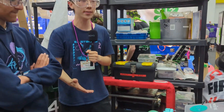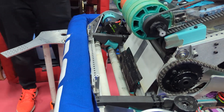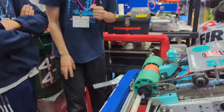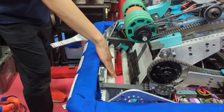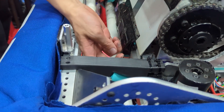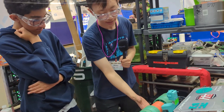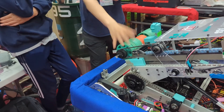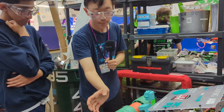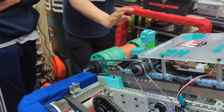Because of the large range of motion the arm requires, it inherently introduced a big gap between our intake and the handoff. We tried to find a lot of ways to overcome this gap. We have several iterations of the intake — we use a polycarb tube with silicone roller setup, a Delrin setup with custom tube plugs, and small 3D printed roller deflectors. This sends the note to the middle of the intake and gets it sent up to the handoff. Because we really wanted to be able to adjust the geometry of the handoff, we made custom compliant wheels — we printed our own mold and hub and cast those wheels.